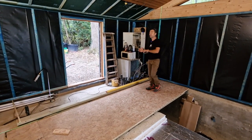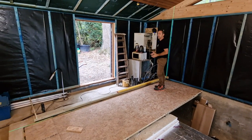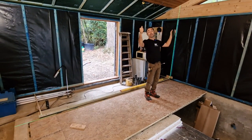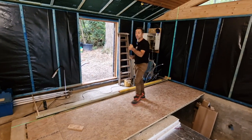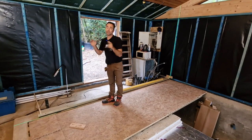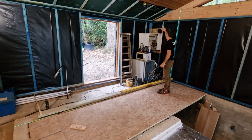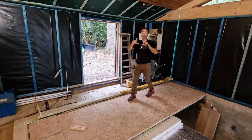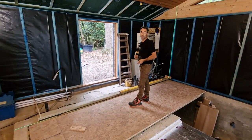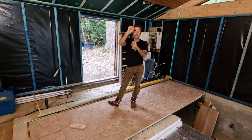Now the reason why we're not going to put the sole plate in, put the head plate in, and then go along fixing the studs is, it's just a much nicer job to make a complete frame and stand it up, plumb it up, so you've got all the fixings done down at low level. We're not standing up here trying to do this, trying to do that. We'll keep the top of the stud square. We've got to bring some cables through into the stud work here, so we'll keep it square, and then we'll make a really nice tilting fillet that goes all the way through the top that we use to fix it in. So that just eliminates the need for trying to make it exactly the right pinch point on the height.